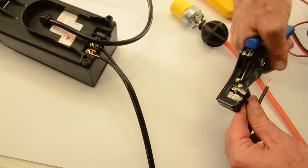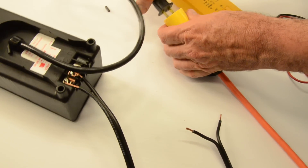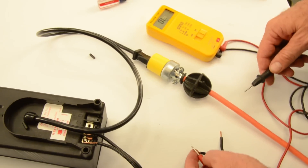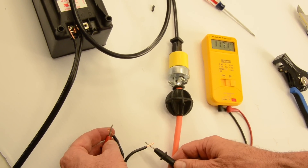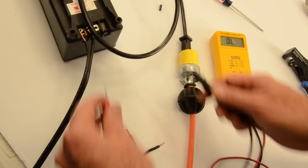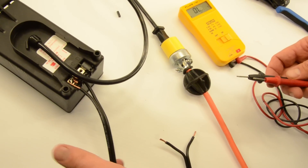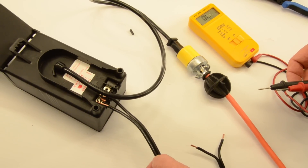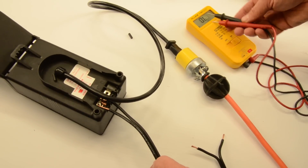I'm stripping the end of the wire 150 feet away from the transformer. Plugging back in to test: on a 14-gauge wire 150 feet away, we have 11.72 volts — exactly the same as at the transformer. So with 150 feet of 14-gauge wire running across your yard and no light fixtures connected, we're losing no voltage at all. This is important, because as we add light fixtures we'll check our voltage and see where we really stand.